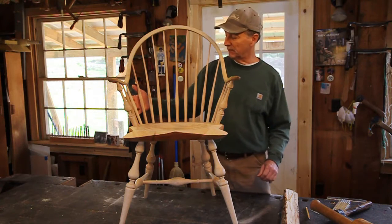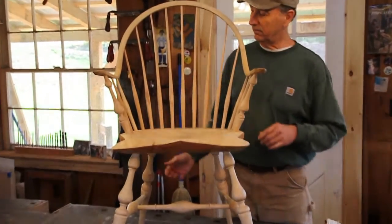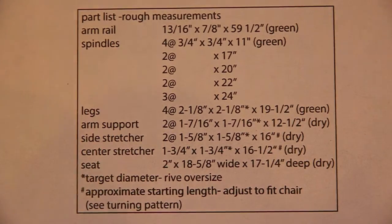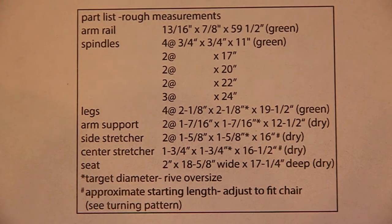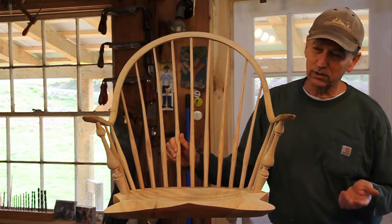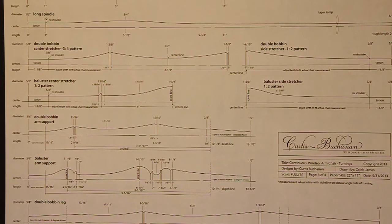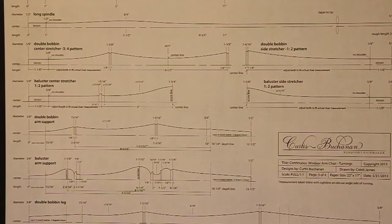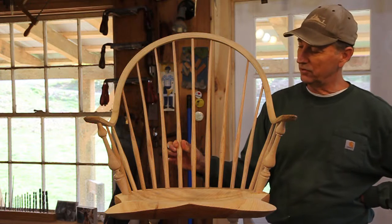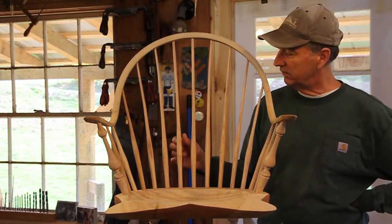There are nine long spindles and four short spindles. If you look on the plans you'll see the lengths and the rough dimension — it shows all of them roughed out at three quarters, and I've got that listed as a green measurement. Where the turnings are drawn it also shows three quarters, but that's not really possible because it's going to shrink as you clean it up. So I rough them out green at three quarters and after they clean up they're smaller than three quarters — whatever you end up with will probably be fine.